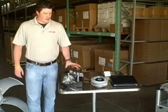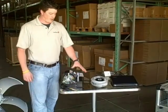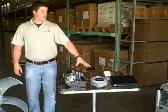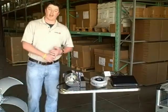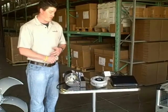Lastly, we can also do single inlet, double inlet, forward curve Ecofit fans. Same voltages as with the Ecofit backward curve: 100 to 120, 50-60 Hz, and 200 to 277, 50-60 Hz.